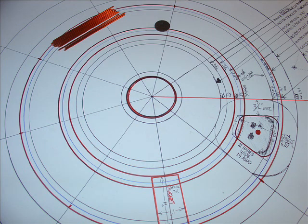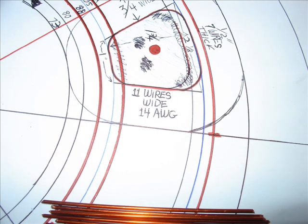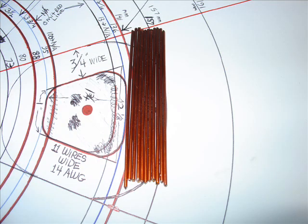Just a little bit tapered in towards the bottom. You see here I've got 14-gauge magnet wire. I've clipped them and straightened them out, very, very tight. That way I can put them down and get the actual size of what my coils are going to be, by knowing how wide so many layers of magnet wrapping is going to be, and then the thickness as well.